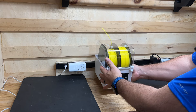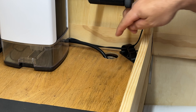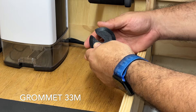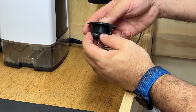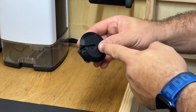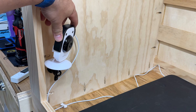I'm putting in a double filament dryer in between the two machines. In case I get a second 3D printer, I'll be able to directly feed it to both through the top access port. This is going to dry my filament 100% to where it needs to be before I start printing. Having a big hole where the electrical cable comes out is not very airtight, so I printed a grommet with a line to allow the cable through. I then cut a piece of Kaizen foam in a circle to fit up in here with a small slit for the wire — it fills the void so I don't need a crazy amount of silicone, and I can easily change it out later.